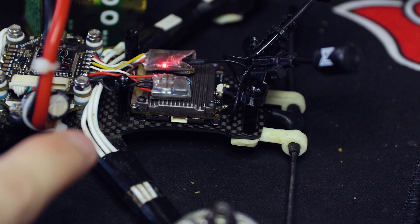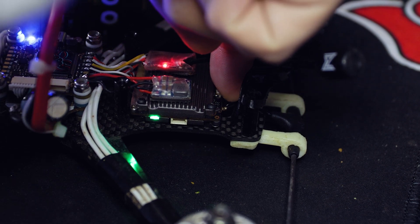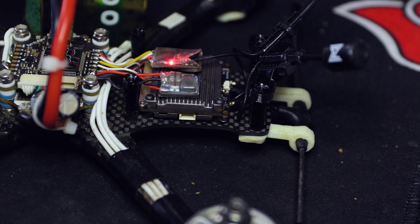After ejecting, unplug the USB - it'll go back to its green blinking standby light. Now hold down the bind button for about eight seconds, or until you see the light shut off. You'll then see a red flashing light, which indicates it is updating. Once you get a solid red light it is finishing up the update, and then it should return back to the green flashing standby mode. Green flashing light means you're all set.